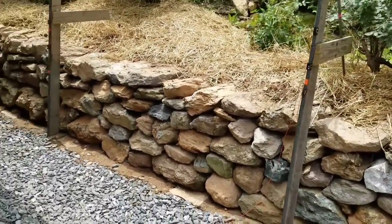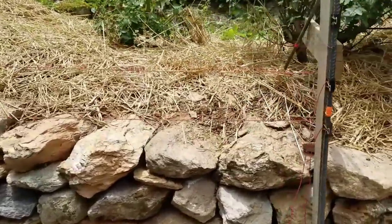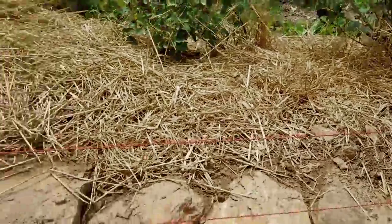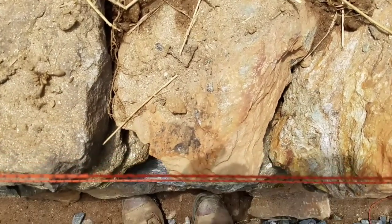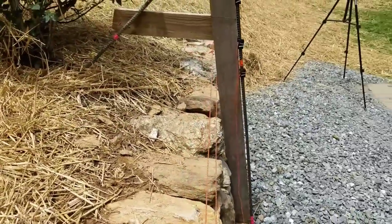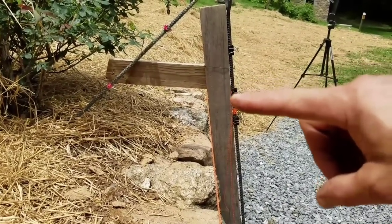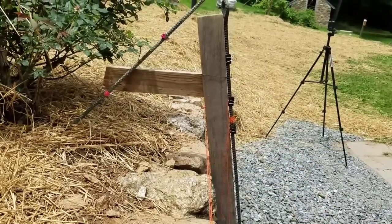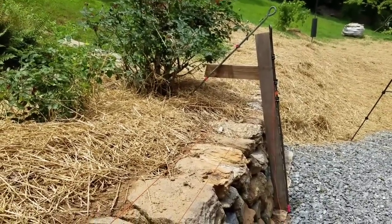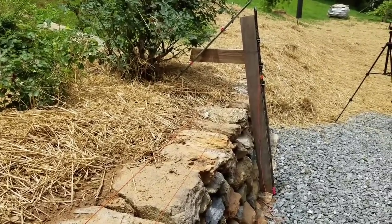Next, we'll talk about the string lines. We have the batter boards both set up — two boards. You can do sections at a time as you're building. I use a two-line system, which is what I prefer, and also spring clips, which are fast and easy to move your strings as you go. The benefit of the double-string line is I can be standing right over top of the stone and look over top to get the two string lines lined up. Some people use a single-string line — it's all personal preference. Basically, you take your single-string line and line it up with the batter frame angle. You don't have to use the clips — you can just wrap the rope or string around your frames at the end. There's another method illustrated on one of my other blogs. Thank you so much for checking out my video. Please subscribe. RockinWalls.com